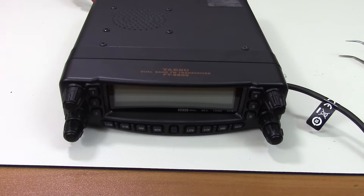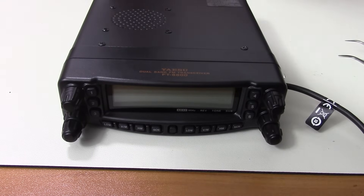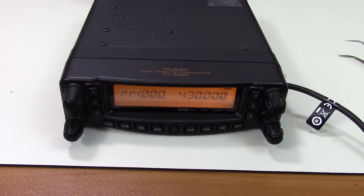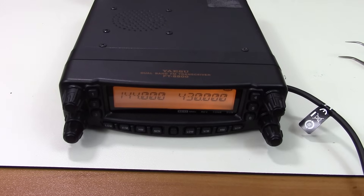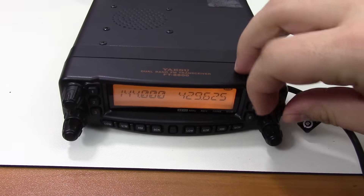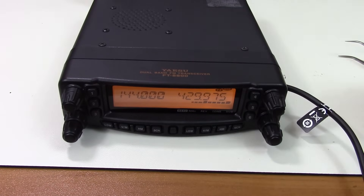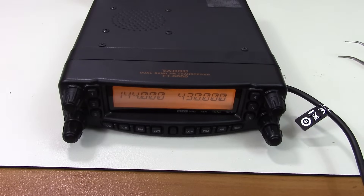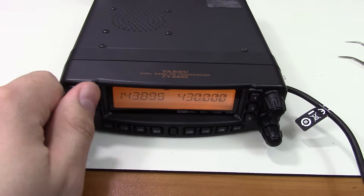The lid is back on. Let me connect the power and fire the radio up. The radio comes up automatically — you can see all the segments on the display lighting up. This is one of the few radios that does not need a manual reset procedure; it automatically understands that something has been changed and performs the reset on power-up. We're on 430 MHz — if I transmit, yes, it works. Going down in frequency, we can now transmit there too. Back on two meters, we can still transmit in the amateur radio band, and we can now also transmit out of band. Very good.